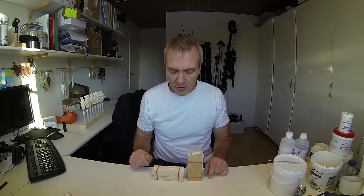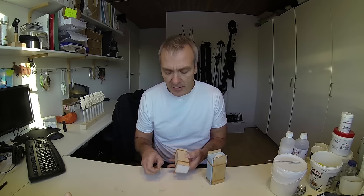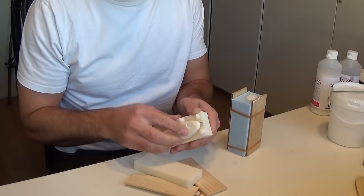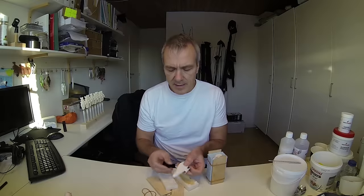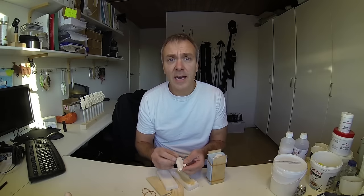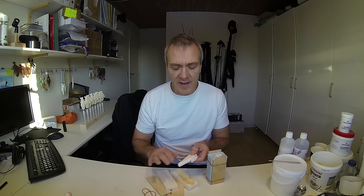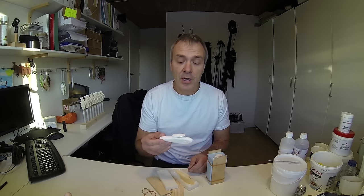Now the casting process is finished and you should leave the mold for the resin to harden. The lure has now had about an hour to harden and I can feel from the funnel that the plastic is quite hard. So it is time to demold the lures — I will just remove the rubber bands and there you go. That is quite a nice lure. The small parts around here I can just break off with my fingers, otherwise I will clean it up with a knife and some sanding paper. Before you start painting these you will have to make sure that all the leftover Vaseline is removed, so be sure to wash them carefully in dishwashing soap. I usually give them some fine sandpaper as well to give the paint a better surface to hang on to.